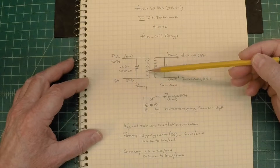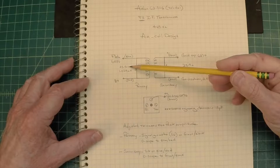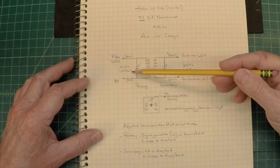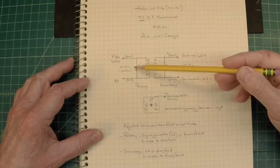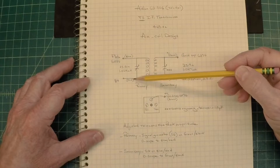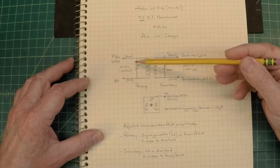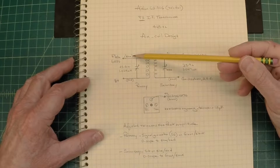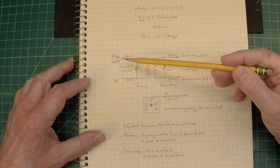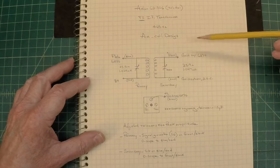You've got the primary here on the left side, and you can see I have the DC resistance called out as well as the inductance at just over one millihenry. I took time to go ahead and put new lead dressings on, based on the RMA specification — Radio Manufacturers Association. So they're recoded now. Blue for the plate, which will tie back to the 6-alpha-8, and the B-plus here being red on the primary side.